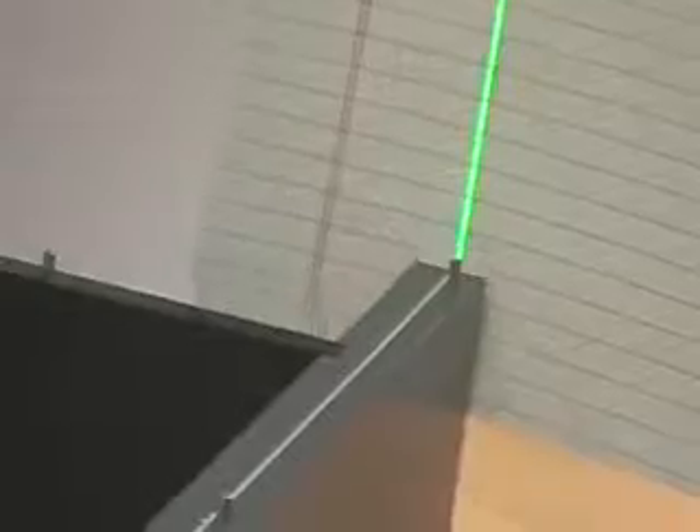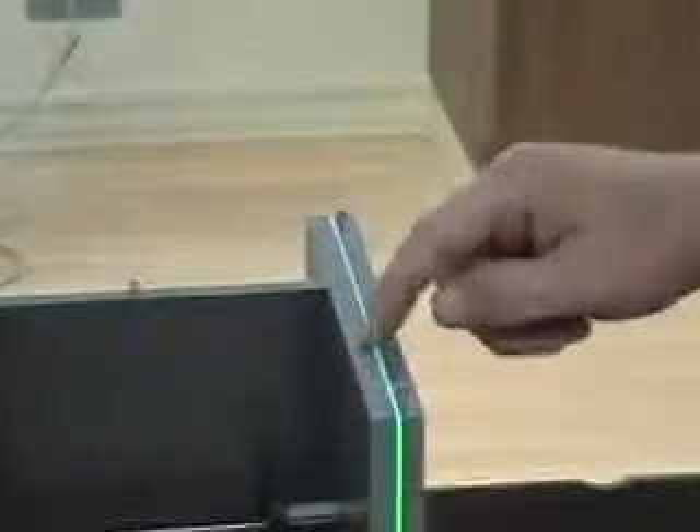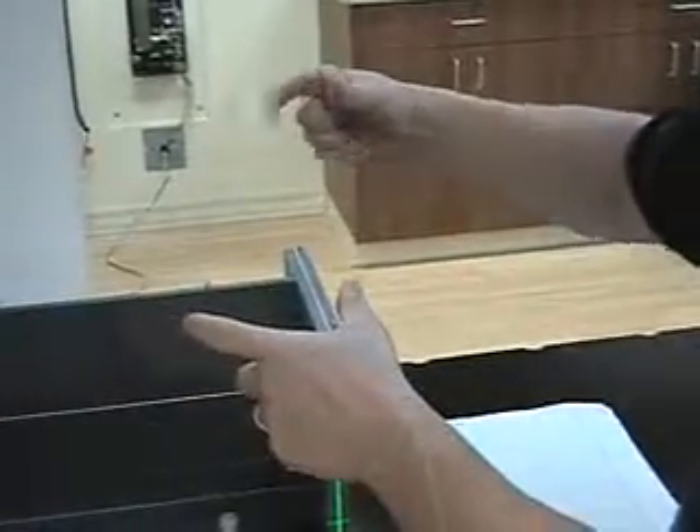Next, you need to check that the angle is shooting straight across — from the Phantom all the way across the white line. As you can see here, we are not quite on the white line, and further along we're still not on it. The line is on the white line on one end but not the other, meaning it's shooting at an angle across. To get that out, we need to move the whole laser assembly over, adjust the skew, and then move it back.